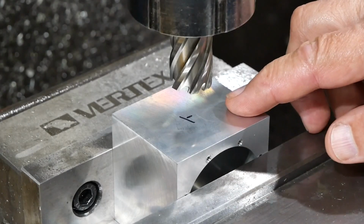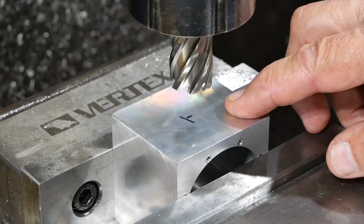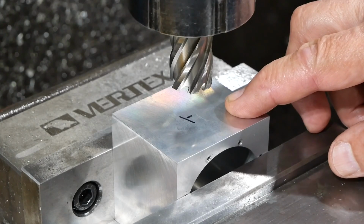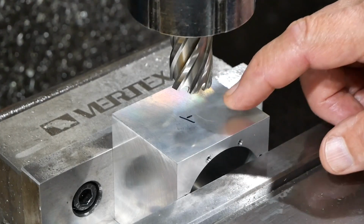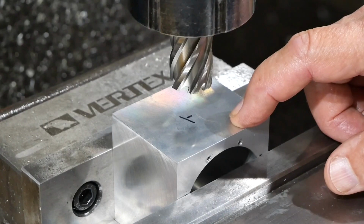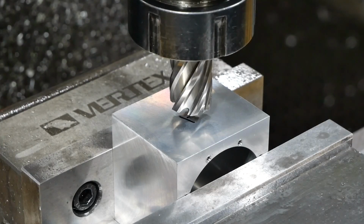But for now I'm going to punch the 36mm hole through the top and drill 6 holes around it, which will be the bolt pattern for securing the cylinder. So I'll do this bore first, and then when I machine the cylinder I'll use this as a size gauge to make sure I get the diameter on the bottom of the cylinder right. Not sure what speed to use for one of these annular cutters. Pretty slow, I suppose.